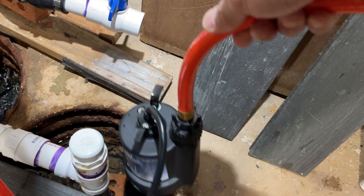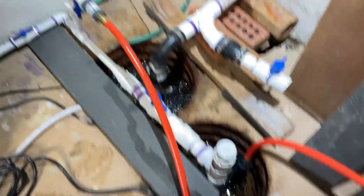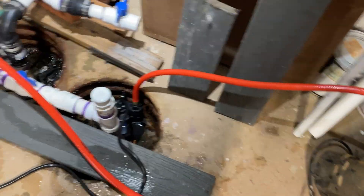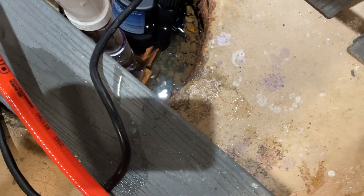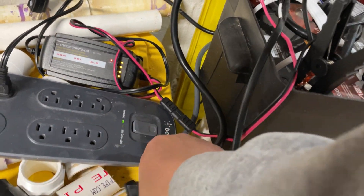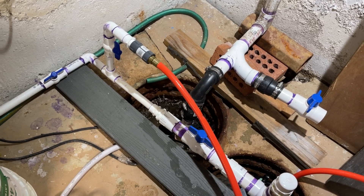Everything's connected - let's go ahead and dump this in. I'll probably do some additional work to put it away properly and secure everything, but for now let me unplug the secondary pump. It's no longer on, so this will fill up. Now let me plug this in - it should be energized. Let's energize that relay. There it is, it's now energized, and this battery-operated pump should not come on. Yeah, I don't hear it.